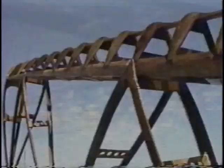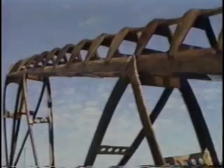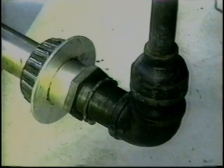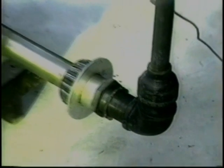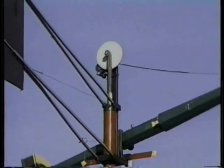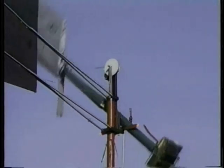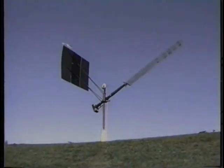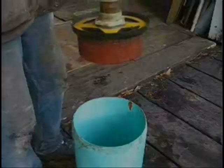The wing's wood frame is a strong 40-pound truss of light and durable western red cedar. The woven polyethylene fabric is wrapped around it, stapled at the trailing edge and heat shrunk. With a coat of aluminum paint rolled on, this very cheap cover will last at least five years in the sun. The pendulum axle is a low-cost threaded pipe with used truck bearings. The counterweight can be a steel box filled with soil. The tail vanes, which yaw the wing and pendulum into the wind, are whole sheets of plywood or metal roofing.